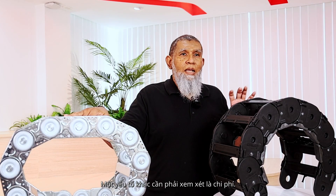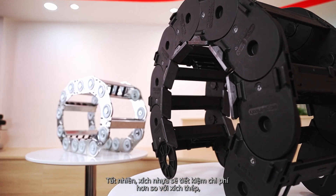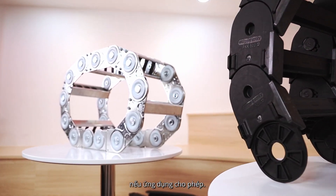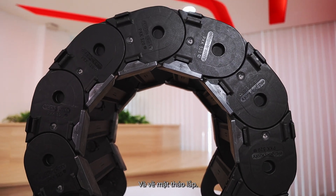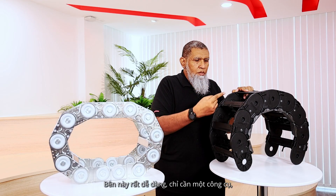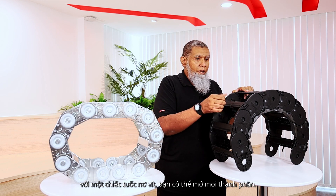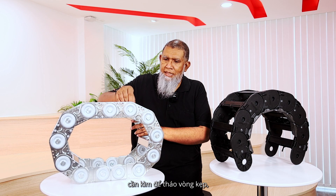There are other things to look at — costs. Plastic chain will be more cost-effective than steel chain if the application allows it. It's also lighter. And in terms of assembly, plastic would be easier — just one tool, a screwdriver, and you can open up every component. With steel, it's a bit more difficult: you need circlips, bolts and nuts to be loosened and all those things. So not as easy.